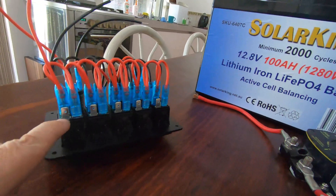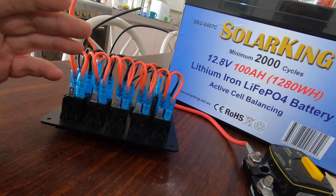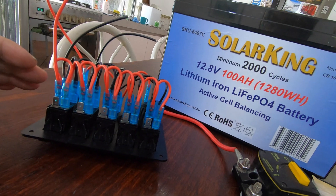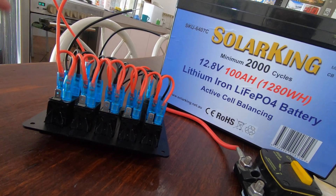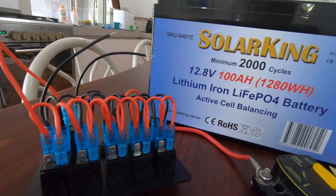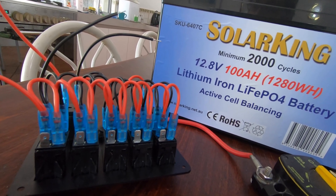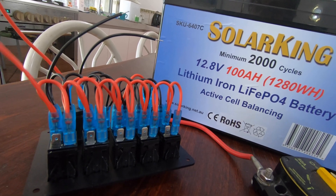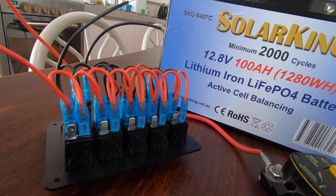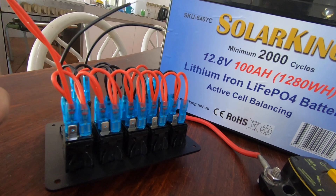The point is you've got five switches. If you've got lights on one, fridges on the other, and something else on the other, you're pulling lots of different amps through different switches. If you're pulling six to eight amps for a fridge — depending on size, start-up amperage dropping down to 2.5 or four — and you haven't got the right size fuse and the right wiring, chances are if you've got a 20 amp fuse but only wire rated to 10 amps going to the unit, that wire is going to catch fire before the fuse blows.